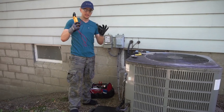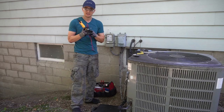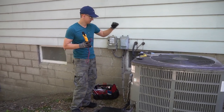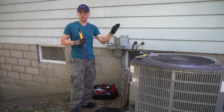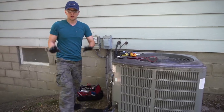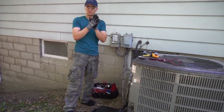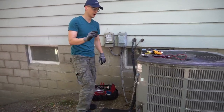Now if you don't have a meter or a voltage pen, you should get one. But if you're still stubborn, then please at least turn off your disconnect and then go inside to the circuit breaker and turn off the AC there too, just to be extra safe. And of course, having some rubber gloves will not hurt you either — electricity does not prefer rubber, so those work well.